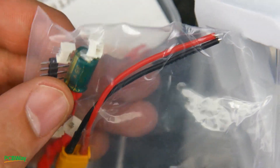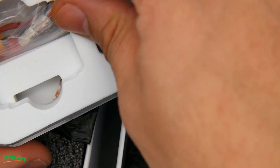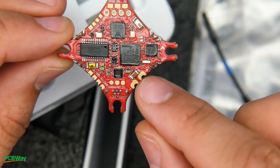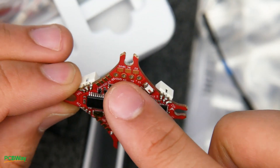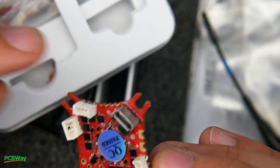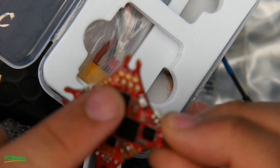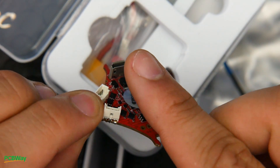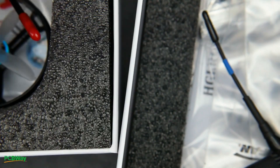It's conformal coated on both sides with pretty tiny FETs — they're using dual FETs for each phase rather than separated FETs, so hopefully this should last depending on your setup. Don't put any high-demanding setups on this — it's a 5-amp maximum. They provide just about everything you need: an XT30, rubber O-rings, extra connectors, and also a low-ESR capacitor. I do highly recommend adding that low-ESR capacitor because filtration is really minimal — basically just one capacitor on the battery leads.